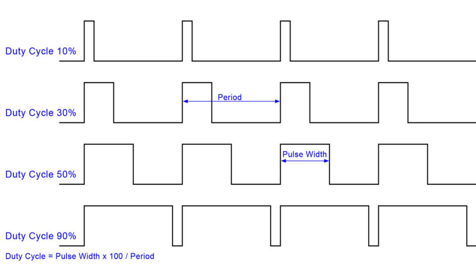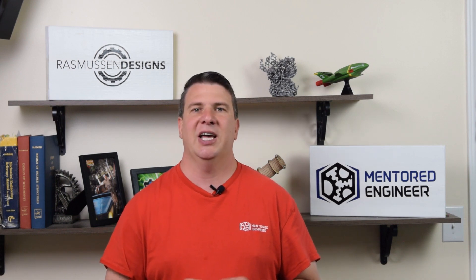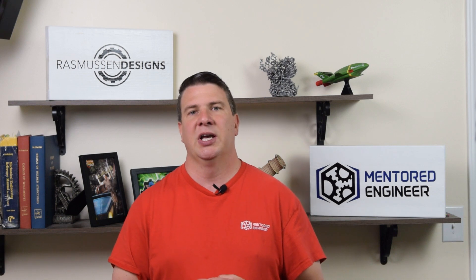PWM means it's going to pulse up to a voltage and we determine how wide that pulse is - how long it's going to be on. If it's on for one second and off for one second we call that a 50% duty cycle PWM - it's on 50% of the time. We're going to look at that current and feed a switch into the microcontroller; if that switch is on it's going to continue to ramp up that PWM until the switch turns off. Once the switch turns off we hold that PWM signal, and naturally the current will decay over time but we'll still be putting in our 10 amps. As it drops the switch turns back on, we ramp up the PWM again, and we keep repeating this process until we reach 100% PWM and full charge.